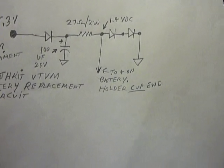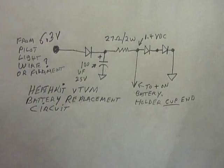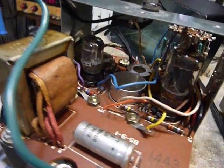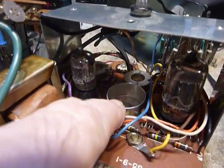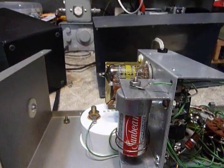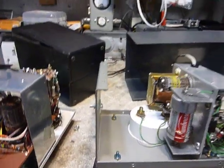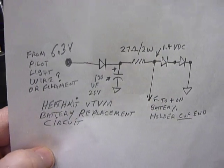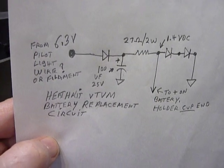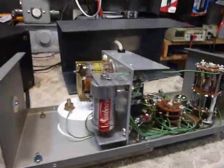So you've got 1.4 volts coming off the bottom line, and that connects to the positive side of where your old battery was. On the Heathkit units, that is a cup — here's the battery cup right here. You connect the positive to that side; the negative is already connected. These work very well and you'll never have to mess with the battery again. It's a great circuit to know about — it was developed by the Heathkit engineers and used on most of the VTVMs in the Heathkit factory.